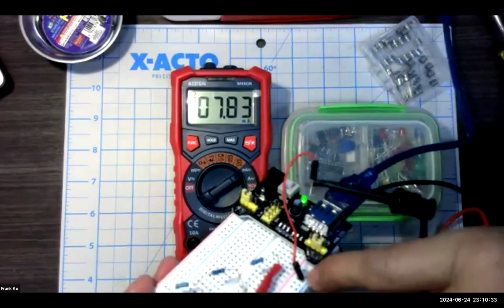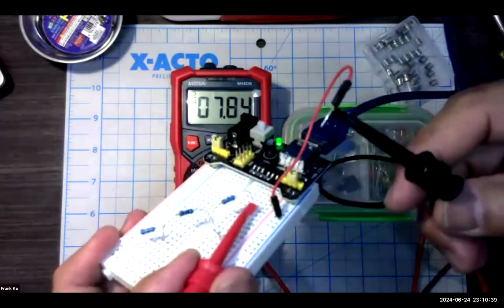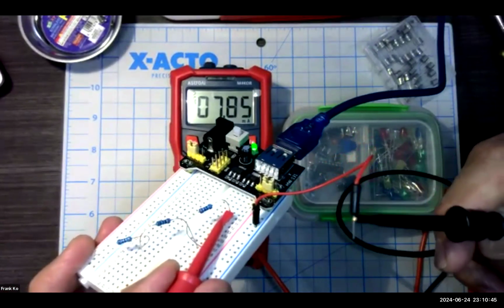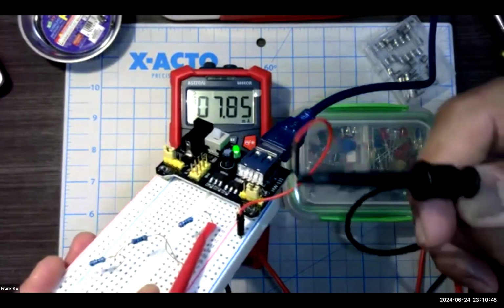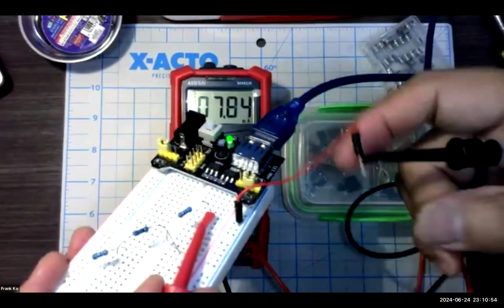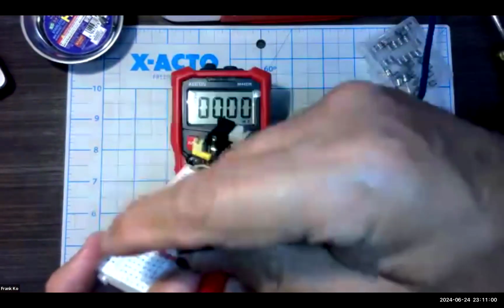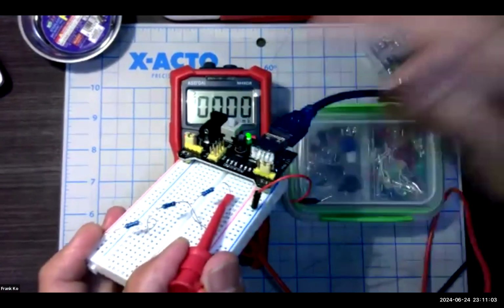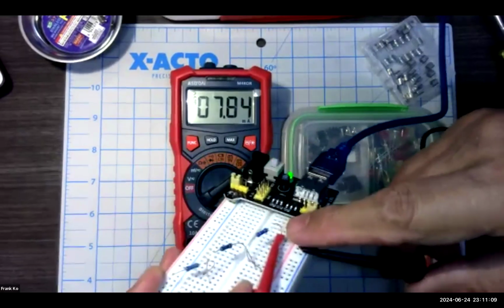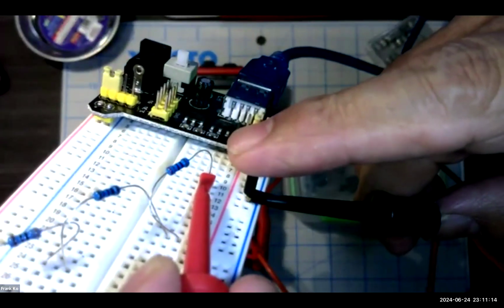Okay. I didn't have enough metal here exposed to grab the mini hook properly. So I'm just hooking up the mini hook to the other end of this jumper wire. And so this mini hook at this end of the jumper wire is the same as touching down here. In fact, this end looks a little longer, so let me change this. Come down here. Okay. And now let me grab this here. Right down onto, yes. And there is my connection of the ammeter to the open.